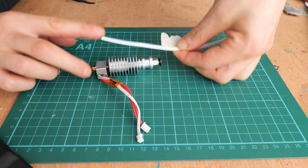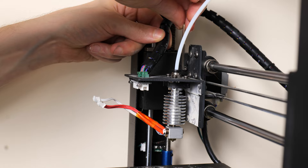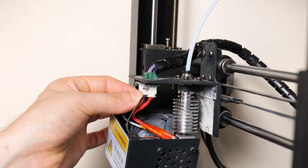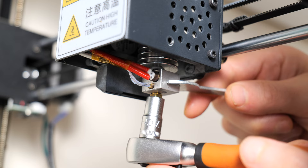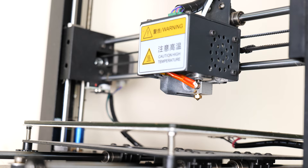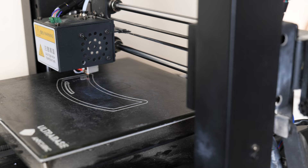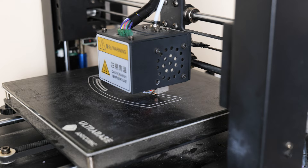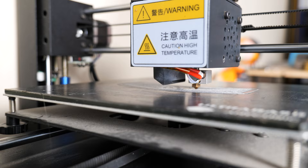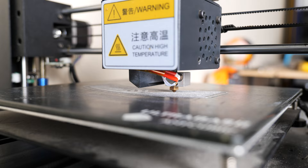And that's it - the hotend is ready to be reinstalled, which is just the reverse of how you uninstalled it. Lastly, preheat the hotend to your typical working temperature and do a final hot tighten of the nozzle and then of the heat block. I'm quite happy I've been able to salvage this hotend. A new one would probably cost about $20 but if you've got a few hours spare you can easily bring one back to life, and I actually learned a lot about how a hotend works doing this restoration. The V5 hotend is a bit of an outdated design now - I think I'm going to be upgrading to a V6 all-metal hotend soon, so stay tuned for that. If you've got any questions feel free to ask, remember to like and subscribe, and if you've got a favorite hotend that you're using on your i3 Mega let me know in the comments below. That is it for today, I'll catch you all later.